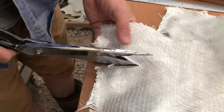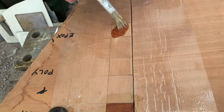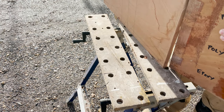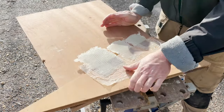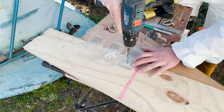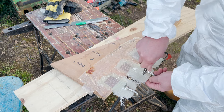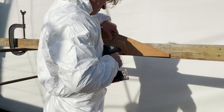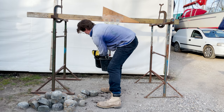However, I really wasn't happy with how subjective this first test was, so I decided to carry out the test again. Although it's far from scientific, what we're going to try and do now is get an actual measure of just how strong these different resin combinations are. The first experiment we're doing here is a shear test, which is a very different force to peeling the tabs off with my bare hands. I was really interested to see how much these little one-and-a-half inch squares would hold in shear.